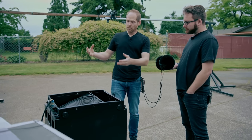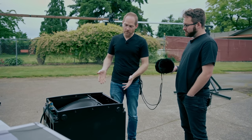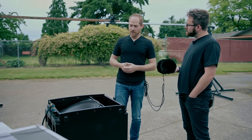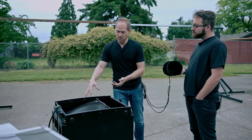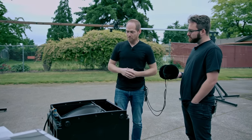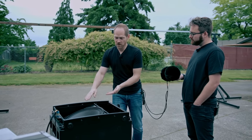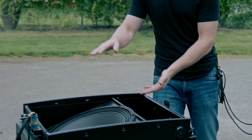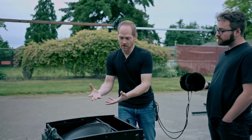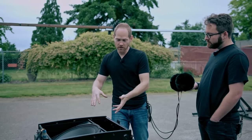So the basics of speaker design: when we put a speaker in a box, we can choose to have it completely sealed or we can have a hole to let the air out. When we have a hole in it, the speaker is typically a little bit louder and bigger sounding, so manufacturers usually choose that. When the speaker moves in, it pushes air out of the hole, and when the speaker moves out, it sucks air into the hole. You'd think those would just cancel each other out — and they actually do. But if the speaker moves fast enough, the direction that the air flows through the opening will actually change direction. So instead of doing a push-pull thing where they're opposite each other, they'll actually move together. When the speaker makes a positive air pressure wave by moving out, at the same time there'll be a positive air pressure wave coming out of the opening, and they'll stack up and move out together, and vice versa the other direction.